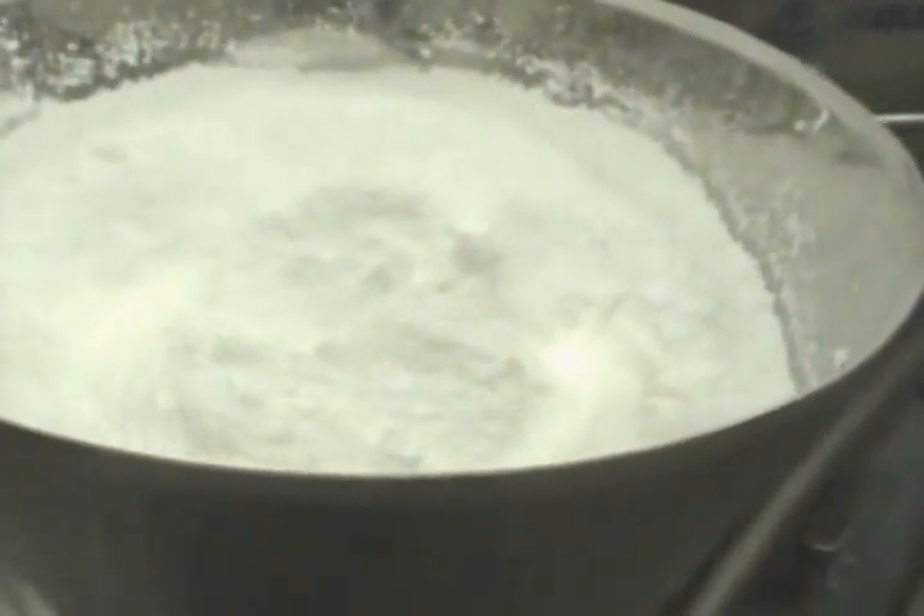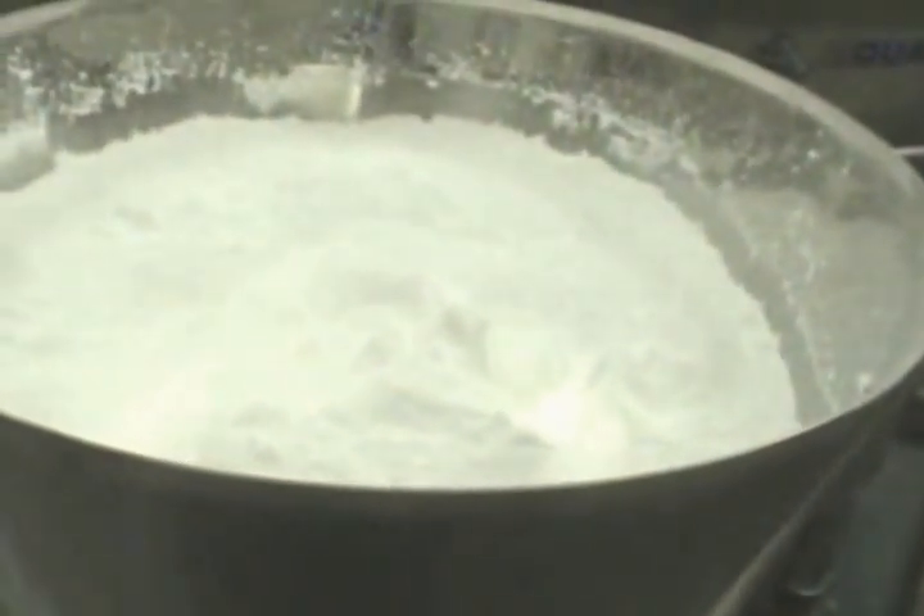It's going to be mass flow, especially on this side here. The intent of the mirror polish hopper is to allow the entire product to flow in a smooth line, fluidizing the powder and preventing rat holes.